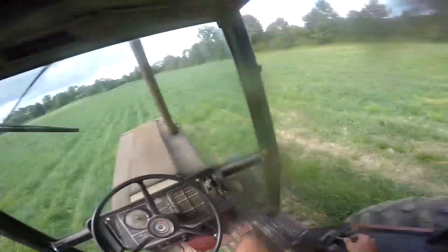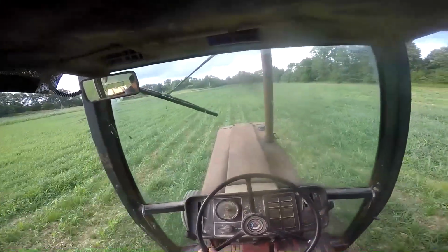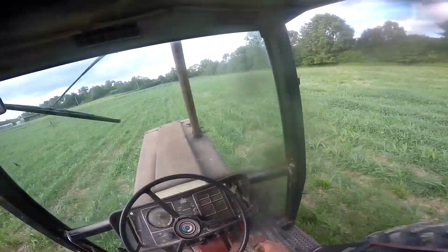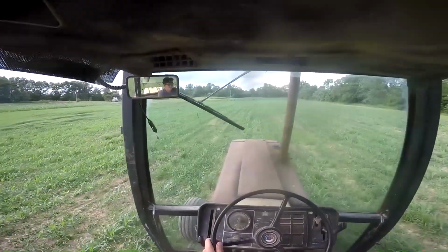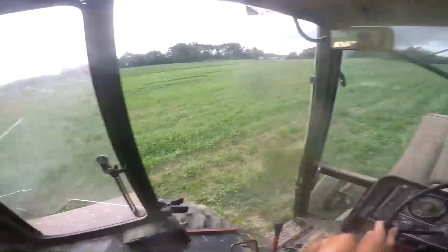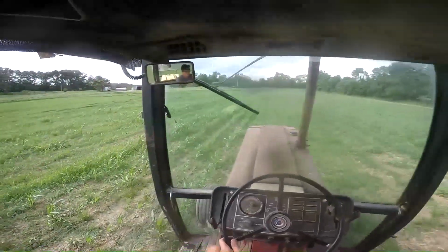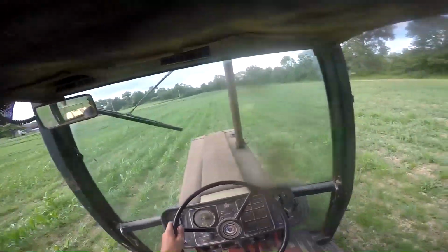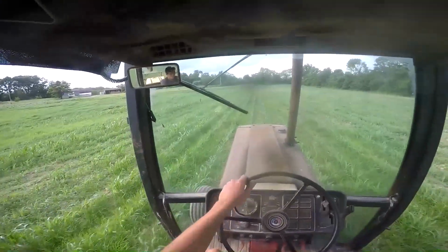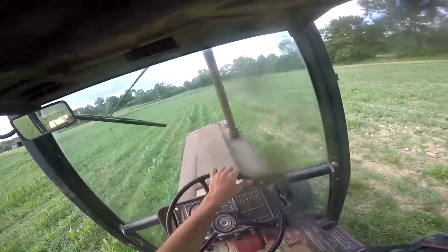We're out here spraying that corn we talked about. It's better to look forward so you can see the rows. It's not the calmest, there's a little bit to wiggle the leaves. But we're spraying a low volatility chemical with a high rate of water, so we're not just straight fogging it out. Going about 4 miles an hour, trying not to bounce across the field too fast.